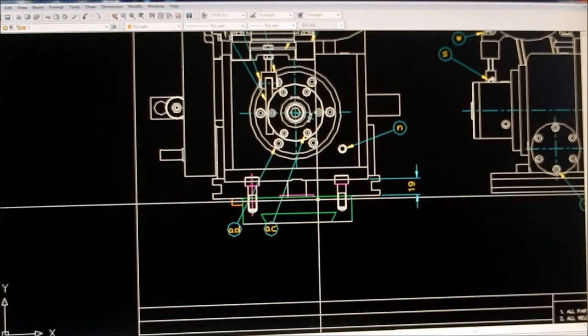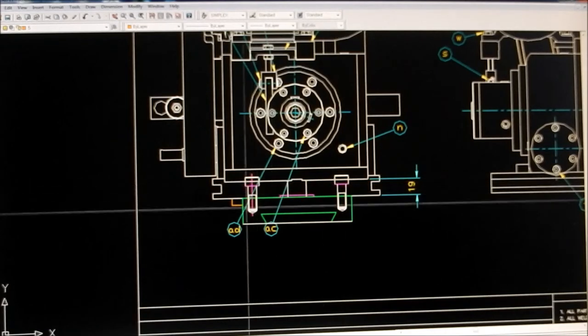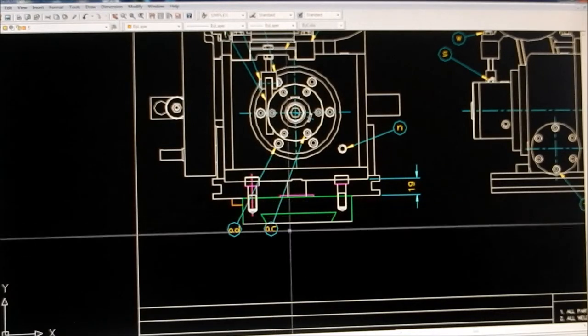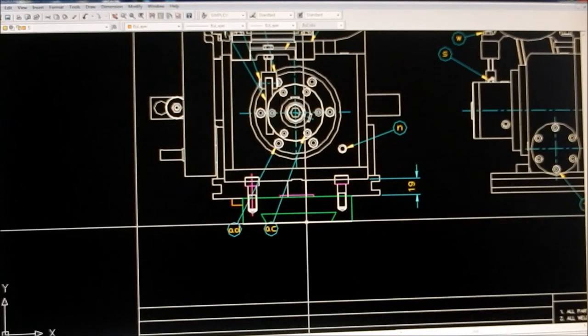I've had to change this design a little bit to suit the mounting holes that I've currently got drilled and tapped into my cross slide, but I've got to do another two holes, which means I've got to pull this assembly apart. That's okay because I also want to measure up the little feed screw on this — it's getting rather worn out and I want to machine up a new one, so it'll give me the opportunity to get that measured up when we strip it out.